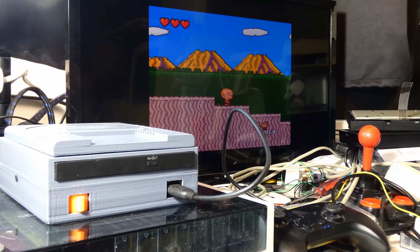Now it's all set up, I'll explain a little bit more about what we've done here. We have a 5-volt power lead coming in the back, and that powers a small USB hub inside - I took a hub apart so it would fit, just removing the plastic casing. That hub is what's being used to both connect and power the CD-ROM, because the Raspberry Pi itself hasn't got enough power for it. There's also a USB socket which has a connector going into the Raspberry Pi where we plug in our controller. You can use Bluetooth controllers - this one is actually Bluetooth but I couldn't get it to pair so it's being used as a USB controller.